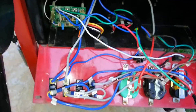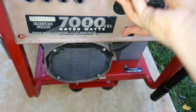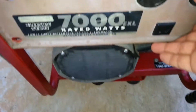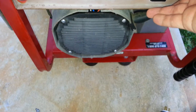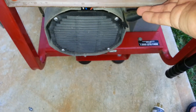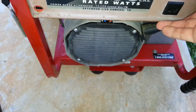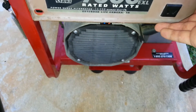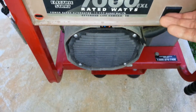This is your hot running for your voltage regulation circuit. It completes the circuit down in the end bell. The neutral of the 120 volts for the voltage regulator is actually inside the end bell — it's on DPE, the blue wire number two, which has a reference to neutral. If you do a continuity test with an ohmmeter between DPE number two and the neutral, you'll see it's a short circuit directly because they're bonded together. That's how it should be.